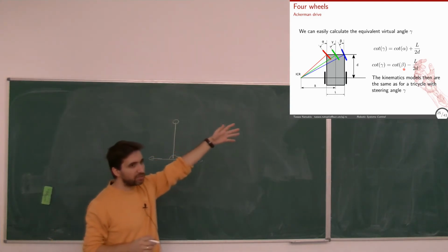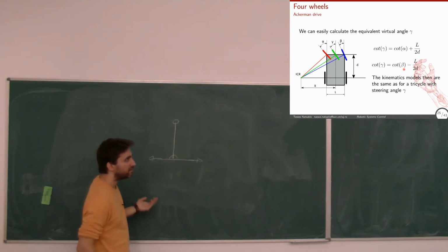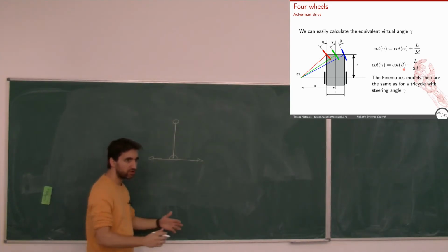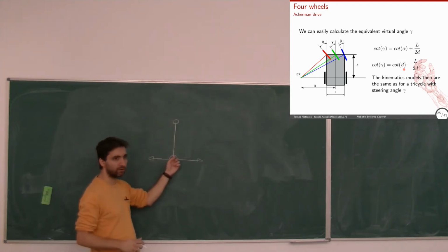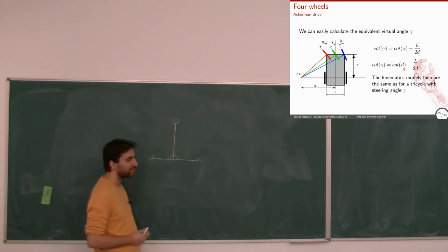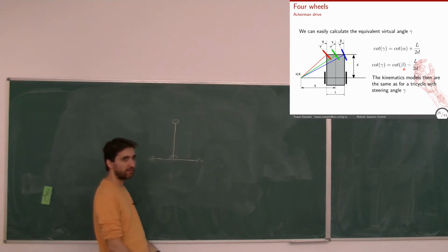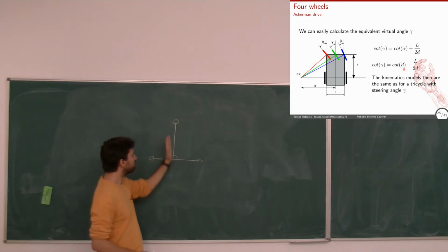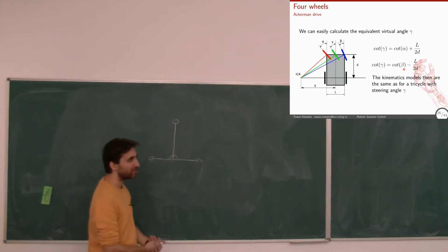Maybe the way I draw the robot here is not so visible, but if you think of a Segway, where it really has a human on top, it's this problem. What the robot does is basically moving back and forward using the two wheels and trying to balance itself. It does nothing else. So if you have a controller smart enough to balance this thing, that's what the Segway does. Or all this fancy skateboard stuff, the one-wheel thingy, it's the same thing. It basically moves itself a little bit forward and backward. You don't really feel it, maybe, unless you're really shaking. But it tries to balance the mass on top. And because the mass, usually a human, is smart, it also has some feedback by itself, so it also tries to balance itself out a bit. So the problem is not extremely difficult.